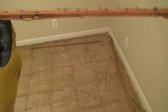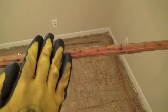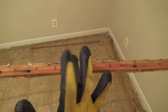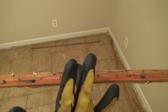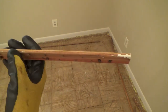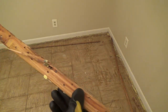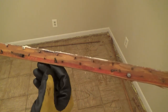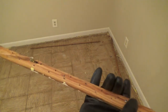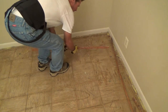As you stretch the carpet, this strip is nailed down and the nails are going that direction. When the carpet hits there and stretches, as it's backing off it gets caught right there. If it needs to be stretched a little bit more, they stretch it and it pushes forward and gets caught on that. Then they tamp it down. Each side has nails — on this other side are the nails that went down into the concrete. Just be gingerly working with these with your gloves on.